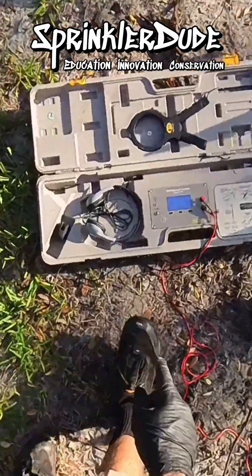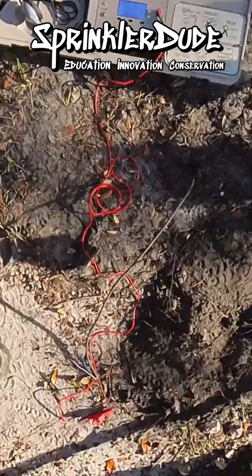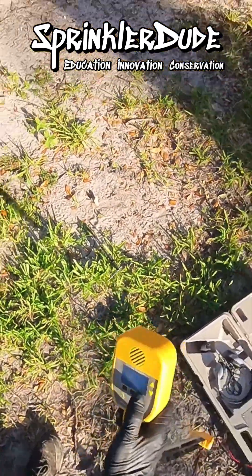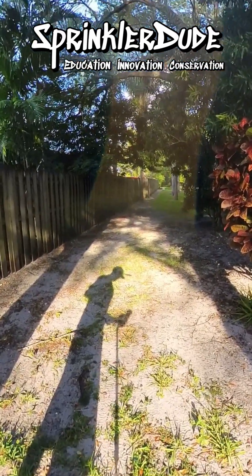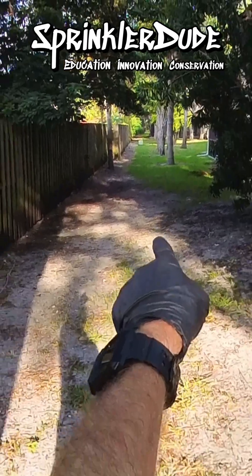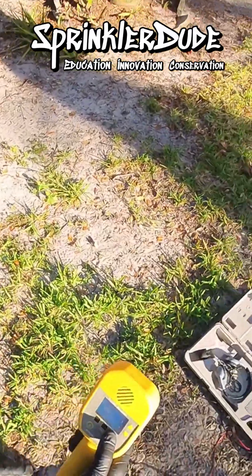I've got my wand over there. We're going to go ahead and hit direct clip-on. I'm going to give it a power level of three for now. We can lower that power level in a little while if we need to, to zero in on what we're zeroing in on. One of the great features of this locator is that it has the ability to drown out some — not all — of the noise that could be in the ground from equipment like you see down there: telephone equipment. They ran some fiber optic cables and high voltage lines through here, so we're going to hear some of that while we're tracking, but this will still pick up the wire.